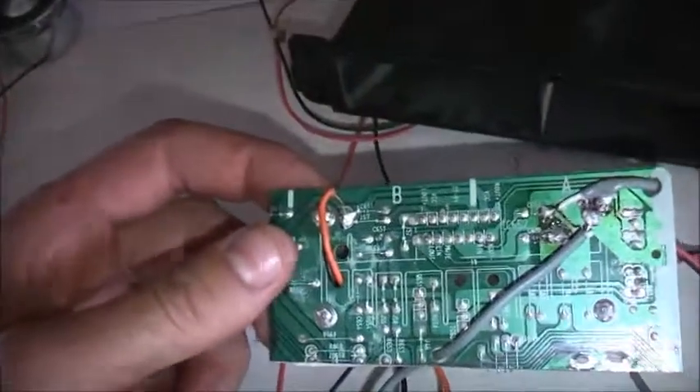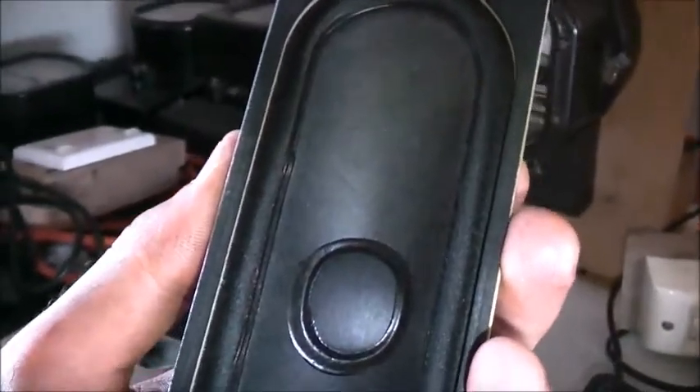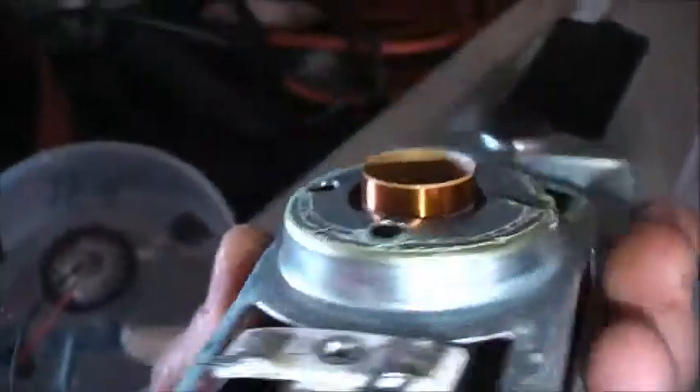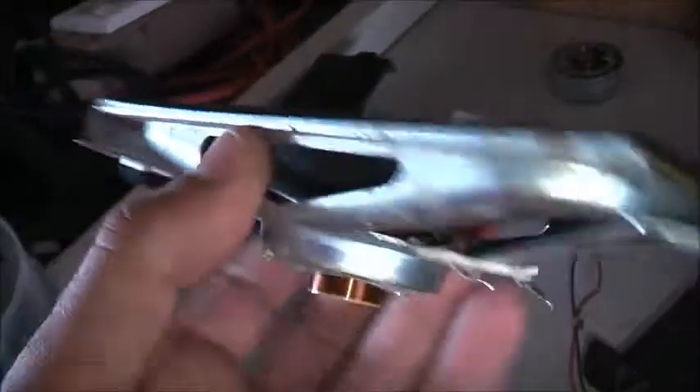Must have just had its circuit boards laid out, because it doesn't work quite as expected. I also found out this speaker was totally open circuit. So I took the magnet off carefully. There's no visible damage or breaks in the voice coil. Only one channel was working, and I tested the speaker, and sure enough, nothing — totally open. Multimeter test, even the continuity test showed a totally open circuit.